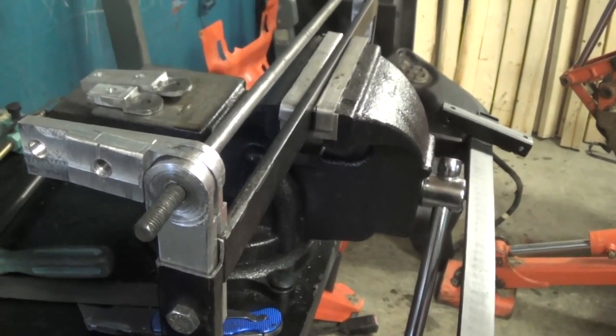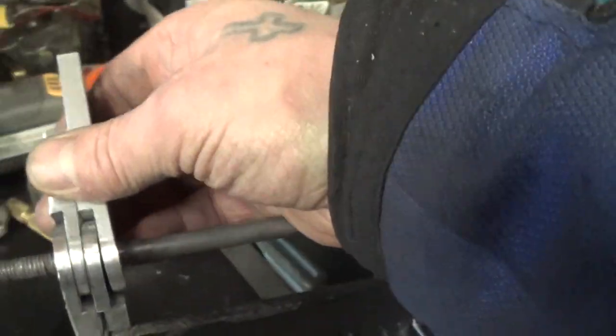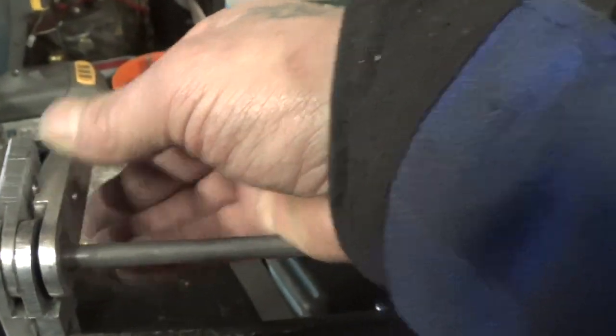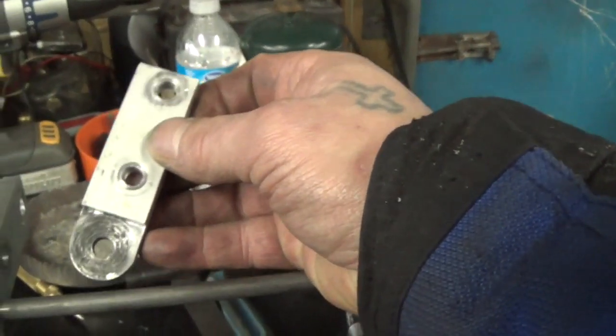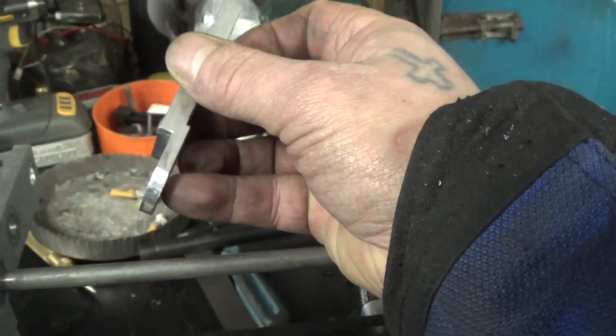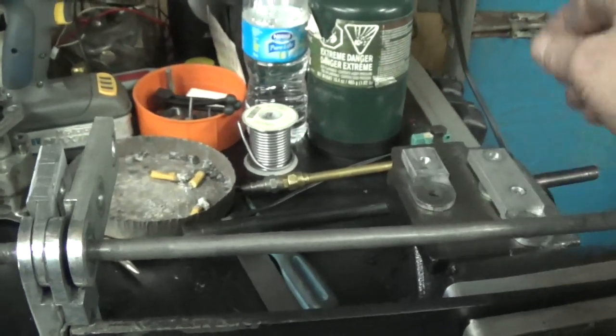So I designed and made for them a couple of years ago these aluminum multi-part hinges for both sides, and after 2 years we're back to the original problem. The guys just don't loosen the clamp enough, and they tend to gall these pieces and wear them so that they don't lock anymore. So what we're going to do is make them a new set from steel.